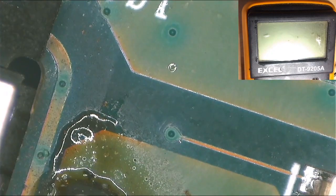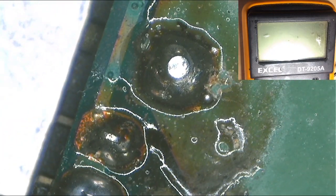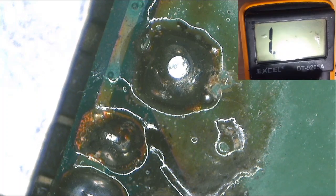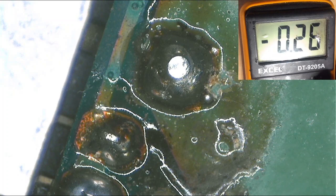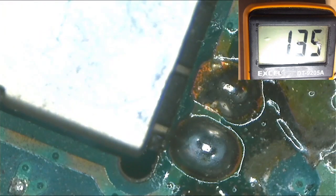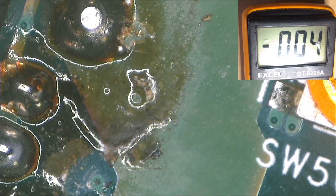Okay guys, here we have a motherboard. So let's go ahead, let's check. This is how you do it. You start from your charging port. This is the DC in jack. All right, so what you do is you change your meter to 20 volts. All right, and then let's go ahead. You connect your charger. This is where you connect your charger, right? The charger is connected.